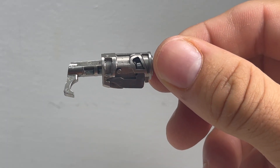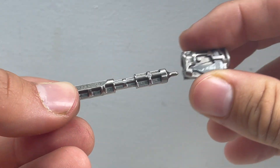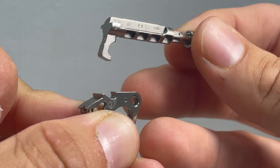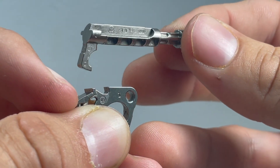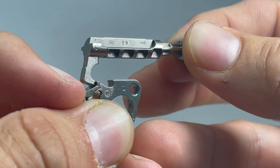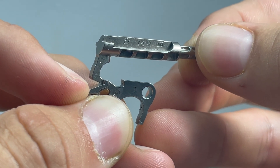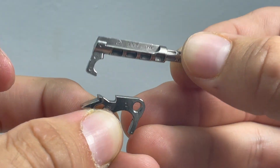To further drive my point home, I have here my striker. It doesn't have the spring or the spring cups. I'm going to remove the striker housing. I also have here with me a spare sear. The interaction between the two parts in the firearm is as such: the striker hook is sitting on the ledge of the sear, and there's a tension from the springs associated with the striker trying to force the striker forward. Until a user pulls the trigger and releases this striker, there is a lot of force — opposite forces — between the two components. That bite, when the sear moves down, that bite until the release, is the movement that you see in the slide as you pull your trigger.